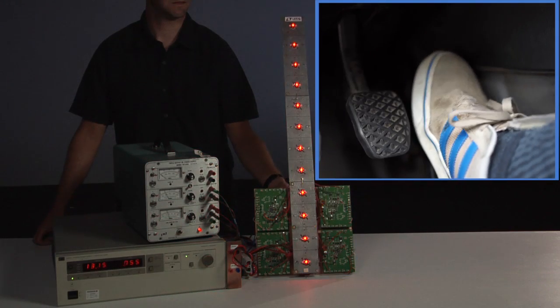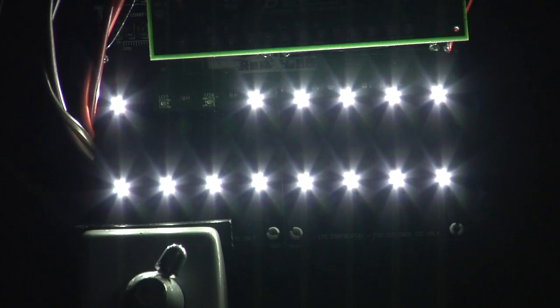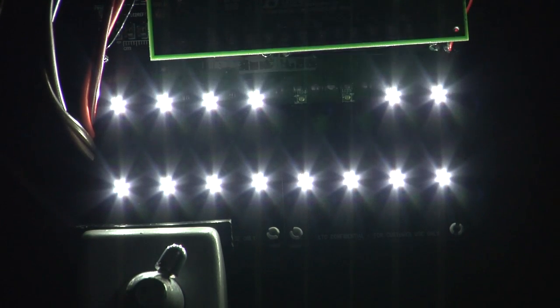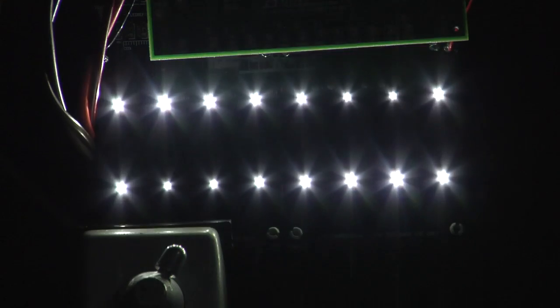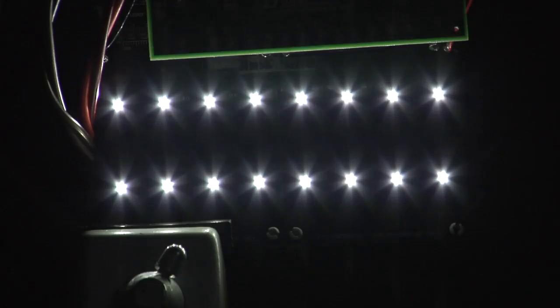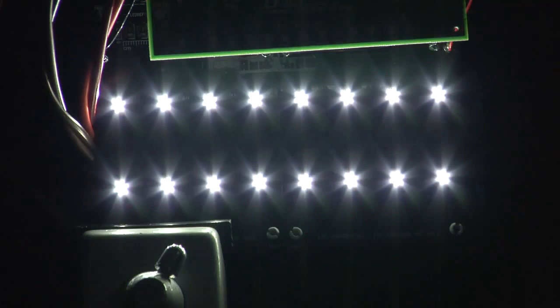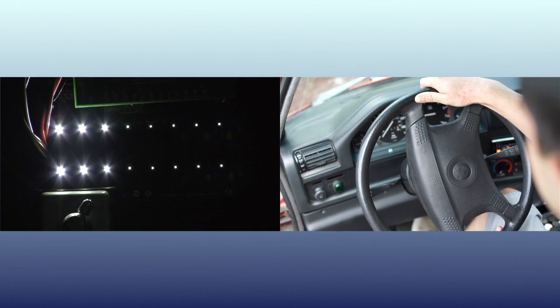With a little bit of extra software, this dual-boost-then-buck LT3797 runs two separate eight LED channels. All LEDs are independently PWM dimmed. Imagine this pattern running around an oversized grille logo. It can even be used for sectional dimming or for side bending lights that activate when the steering wheel turns.